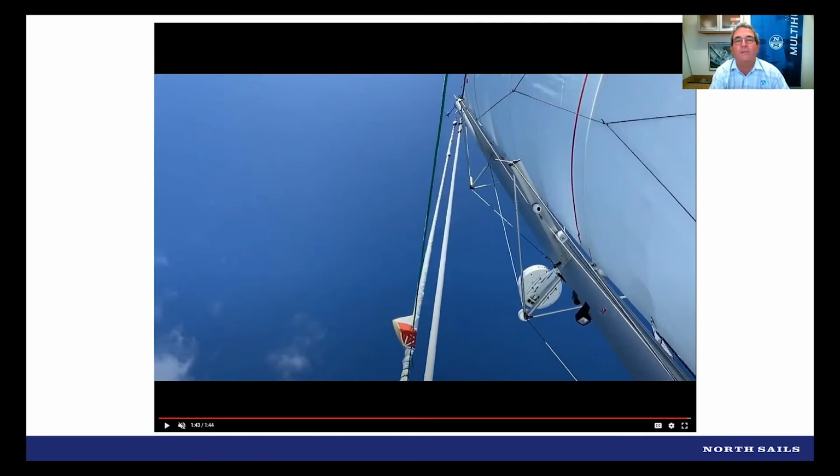One thing, despite the fact that it looks like a nice snug furl, these sails cannot be left up. The next thing we do right now is take that sail down. Nylon like this is very UV susceptible. It cannot have a sun cover. While you might cruise around for another couple of minutes like this, it's best to get in the habit of, once you furl this up, go ahead and take it down.